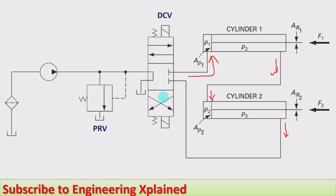When the direction control valve is at the bottom envelope, fluid from the tank flows to the rod end side of cylinder two, and retraction of cylinder two starts. The fluid from the blank end side of cylinder two flows back to the rod end side of cylinder one, so retraction of cylinder one also starts with the same speed. Both cylinders are synchronized to carry the load.